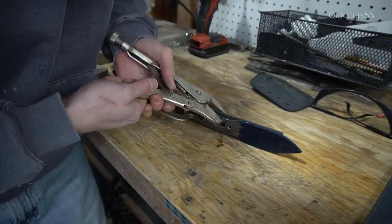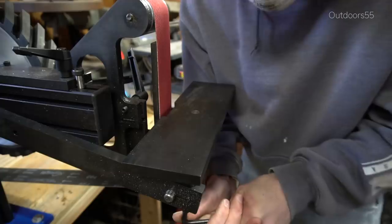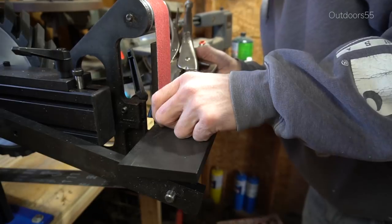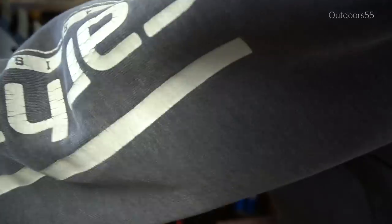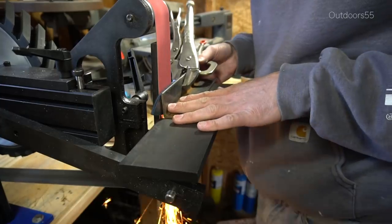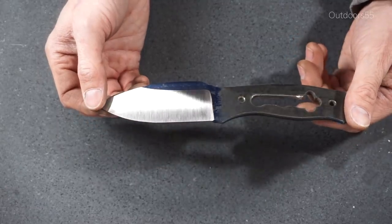So now it's back to the grinder, my favorite thing. What I'm doing here is I'm taking a piece of angle iron — nothing special, just a piece I bought from Home Depot. I cut it to length and essentially what I do is I clamp the blade to the angle iron and then tilt my work rest to the angle that I want to be grinding to. I've been asked how I knew what angle to set my work rest to match the bevel I'm trying to grind, and to be honest I just sort of guess at this. A lot of times I don't know the exact style of knife I'm going to be making. At this point I didn't think I was doing a full flat grind, but halfway through I realized it would probably be a better knife if it did, so I just adjusted my work table until I got the grind I was looking for.